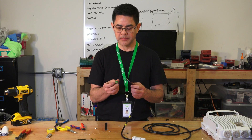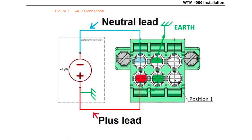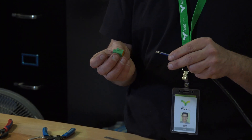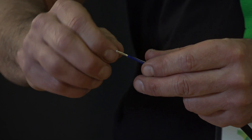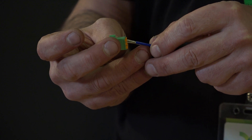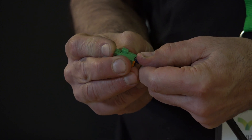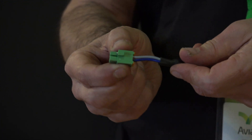At this point we're ready to put them into the connector. Looking at the wiring diagram, make sure to insert the wires into the correct holes. Insert both wires at the same time — do not press the orange tabs. These connectors work by pushing the wire in and it locks in place; press the orange tab only to release. Make sure there are no stray wires, get proper orientation, start both wires, then gently push forward until they go into the connector right up to the insulation. There should be no exposed wires — the connection is now secure.